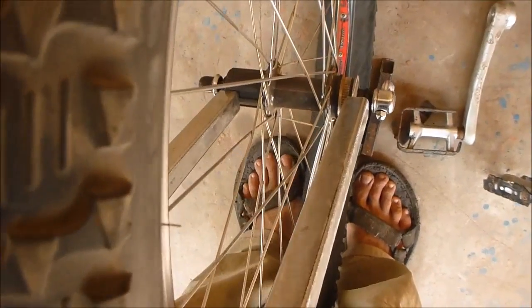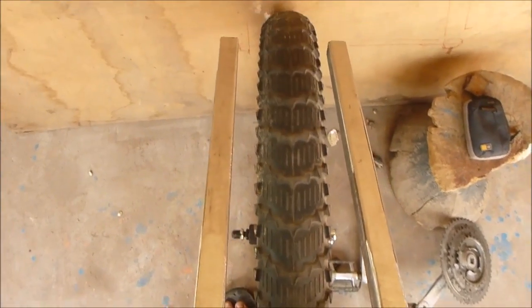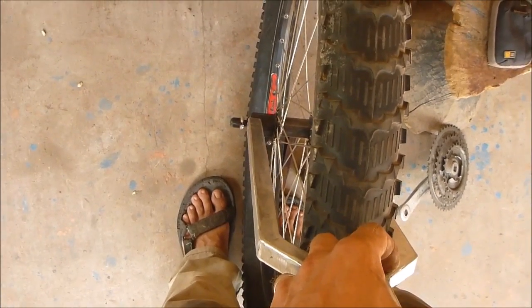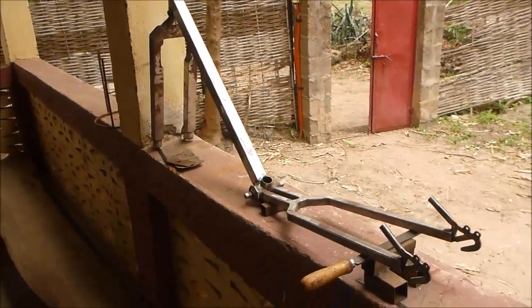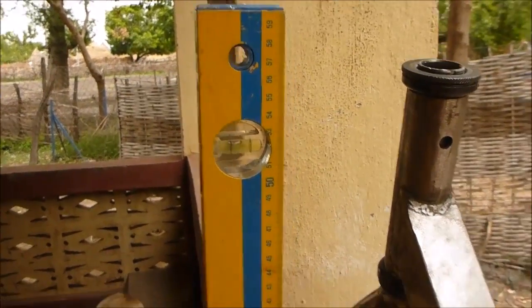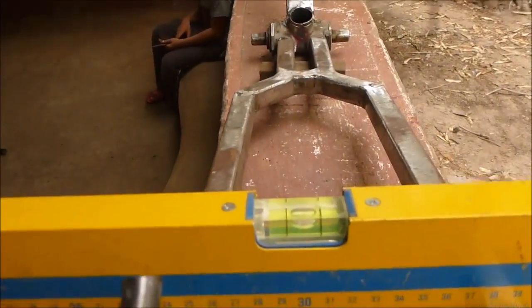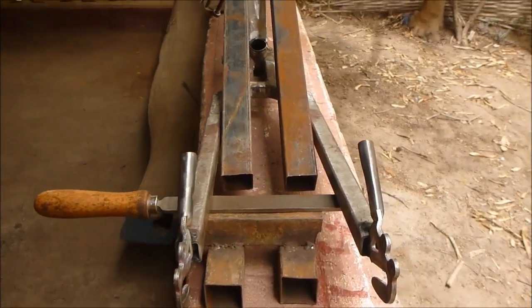See, here's the slight problem. Those come to the wrong spot. I was thinking the outside is 14 centimeters, but that's not where the ends are going, so I've got to do a little adjustment here. Alright, trying to get this thing lined up and then weld right there. Right now this looks pretty good there, and that's pretty good there, so these are perpendicular. I've put 2 guides in here. This should help line up the back end here.